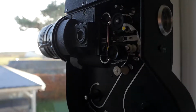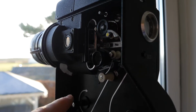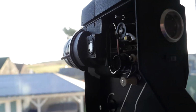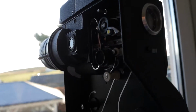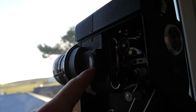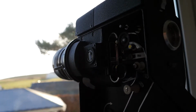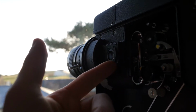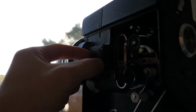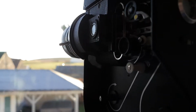Today I'm doing a bit more work on the Scoop-It camera, and I'm trying to test the focus on it to make sure it's working properly. Now there's a way you can do that without even using any film, because in some cases the reflex focus isn't actually accurate and it doesn't always properly reflect the actual focus that you're getting through the film gate. But I've fixed that in my case by putting foil shims on the ground glass piece, basically just moving it out a little bit, and it now matches up.